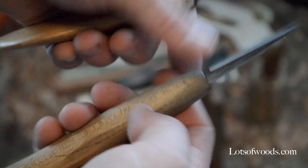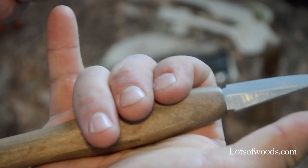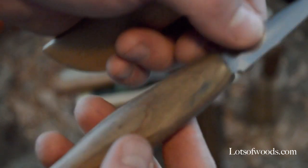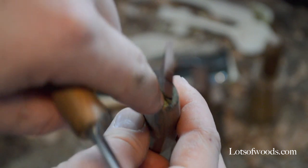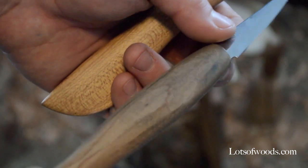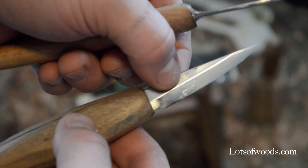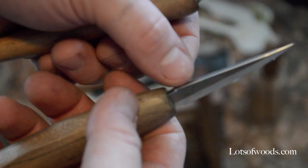Let me explain briefly why I changed the handle. When I would hold the old Mora knife, the handle would stop at my pinky, so my pinky was sliding off and I was basically holding the knife with just three fingers. I wanted some leverage when using the knife. So I slapped together this very basic handle. I used a drill to drill a center hole and then tilted the drill because the end of the stock of the blade is kind of wide and flat — that's how I got it in there. It was very simple. It's not to look pretty, I just want it to work well. My hands have adapted to the knife and I can use it well — that's what's most important. If you do have a Mora knife, I would recommend trying to make your own handle and see if it works for your carving style.